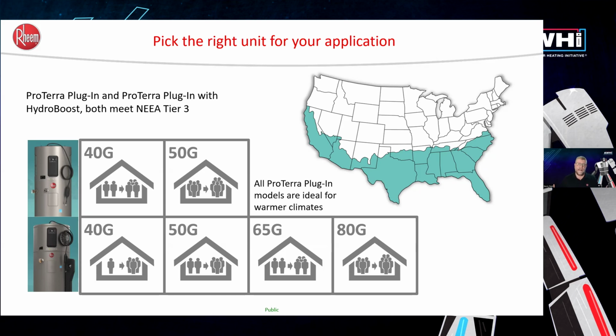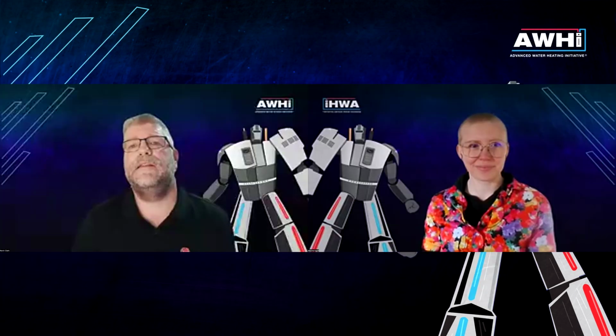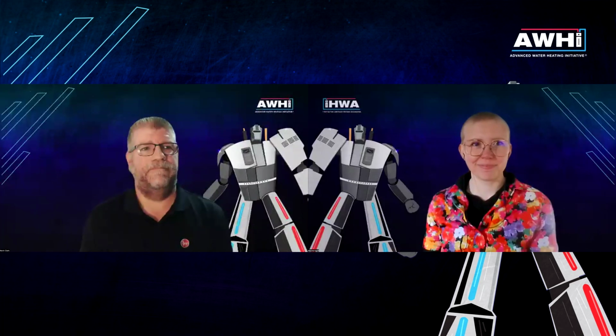Again, if you look at a day's worth of hot water, a typical average family of 4 is going to be in that 60 to 65 gallon range. So again, when you're sizing these things, you have a day's worth of hot water at any given time. It doesn't really matter if it's going to take a few hours to recover that tank or not, or sometimes up to 5+ hours if it's an 80 gallon. So that's what I had to share. I'm going to stop sharing the screen here, and we'll move it along.